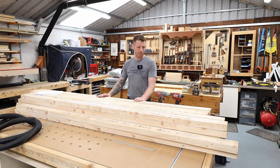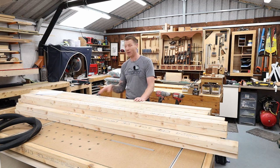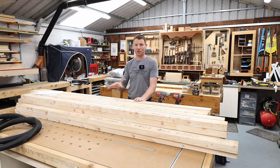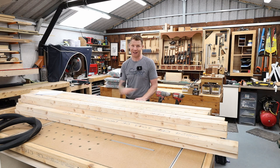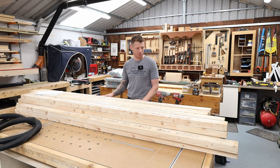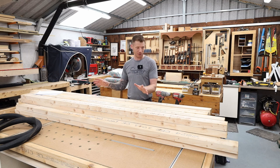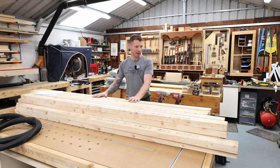This timber is not planed all over, so it's a little bit rough and a little bit cheaper. It's non-pressure treated, but I am going to be painting it. I have stuff in my garden that's been four or five years non-pressure treated, treated every year myself, and it's holding up fine. It just means I'm going to sand every one of these — 80 grit first to pre-prepare, then sand the bench planks to 120 grit. The frame can stay at 80 grit, that'll be fine.